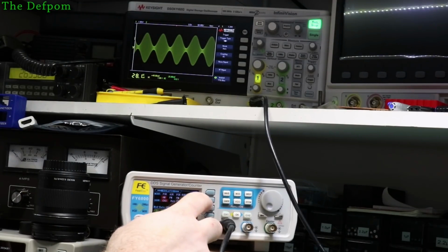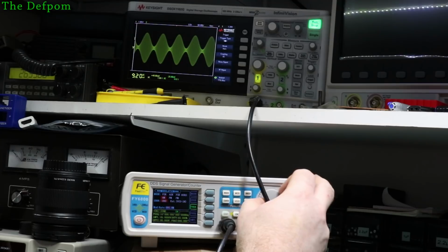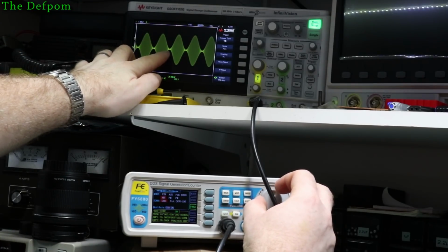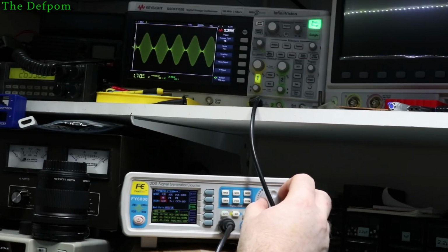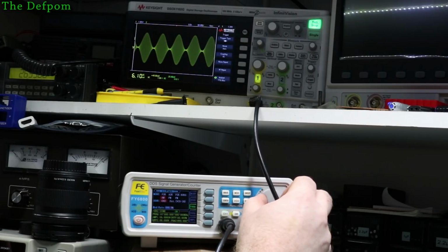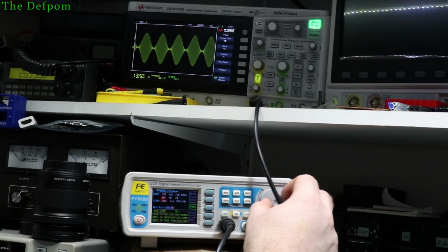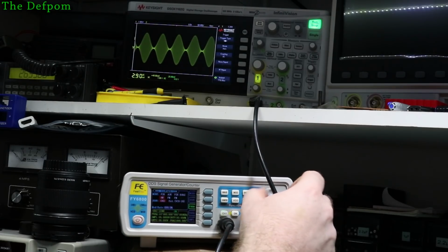That's for a 90% waveform. If I adjust that parameter there, you can actually do up to 200% modulation, which is quite interesting. But as I bring it up to nearly 100%, I don't know whether you can see that on screen, but 99%, that basically is 100% wave modulation, right? And at 100%, it's actually over modulating very slightly. It's got a little bit of a flat line there. Right, so it's actually a little bit too much. I'd say probably about 99.6 is 100% modulation. It looks like it's very slightly out, going by that. Okay, not a big deal, but it works nice enough.